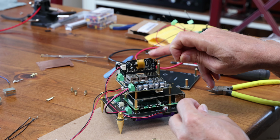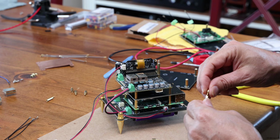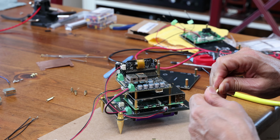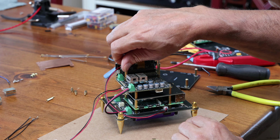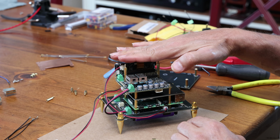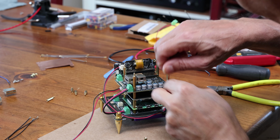So the whole idea is to clear the Monitor Pi Pro, because that thing is noisy. The clocks also, they're very noisy. They actually don't want to have noise around them, but themselves are noisy. So you need to clear all this noisy parts so it does not affect your next stage. So that's why we're going to build a little bit higher to clear everything, and then we're going to put a shield. And this is the last one of the 4.